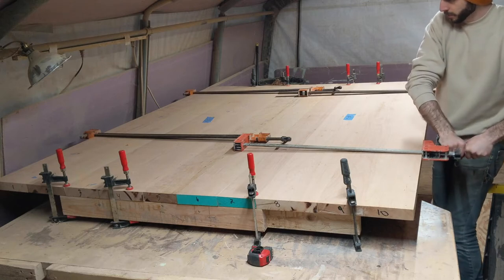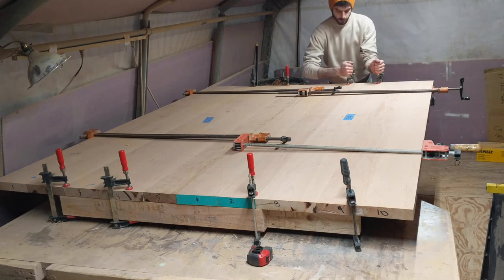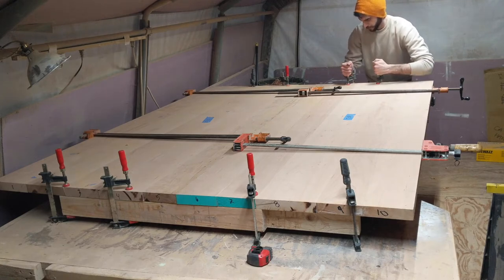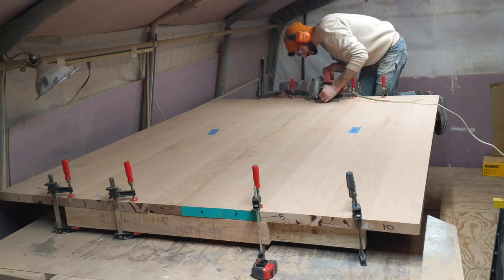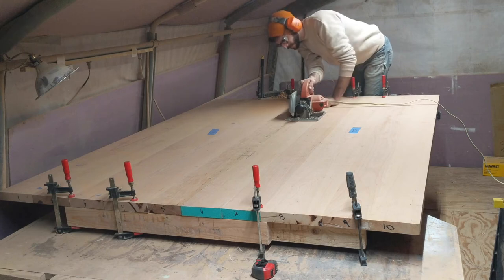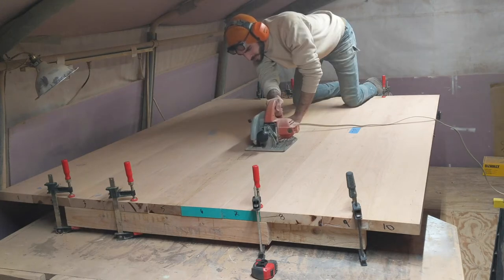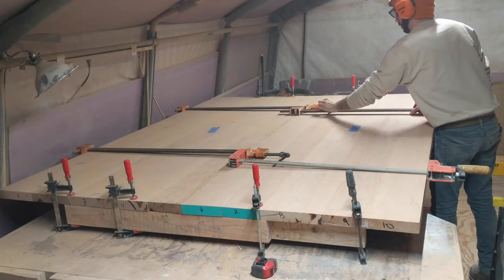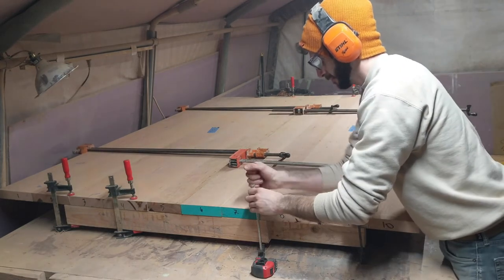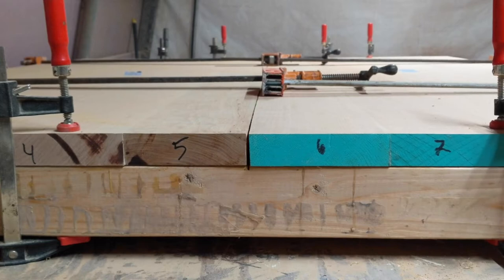After gluing the two halves, they didn't quite meet together nicely, so I had to close up the seam down the middle. I raised the top onto two 2x4s and clamped the two halves together to close the seam as best I could. Then I clamped each half to the 2x4s and removed the longer clamps. Now I can run my circular saw blade down the center of the seam, making sure to remove material on both sides as equally as possible. This cut didn't need to be perfectly straight, as any inconsistencies are mirrored between the two pieces and cancel each other out. This was still a very nerve-wracking process as the table top was very close to its final width, but after a few passes I got lucky — the table top ended up at its final width.